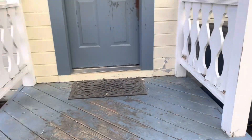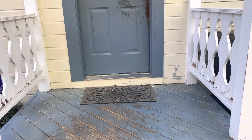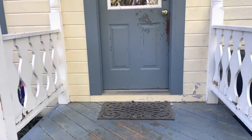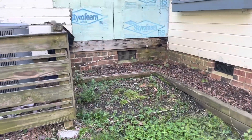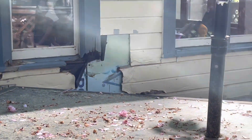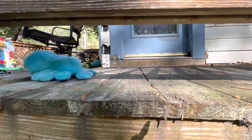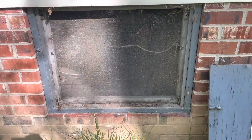This is one of the areas we're going to check simply because it's underneath a doorway. You see a lot of rot underneath doorways, although this one is covered so it's probably going to be okay. These other areas here are areas of concern that we'll look at, and this would be an area that would be suspect as well.